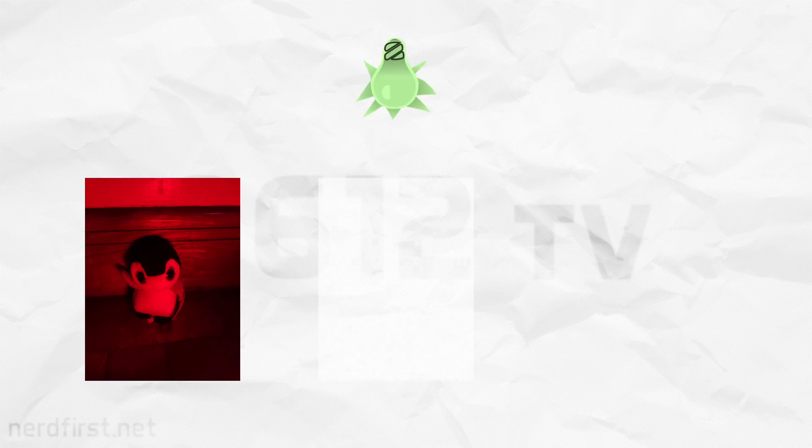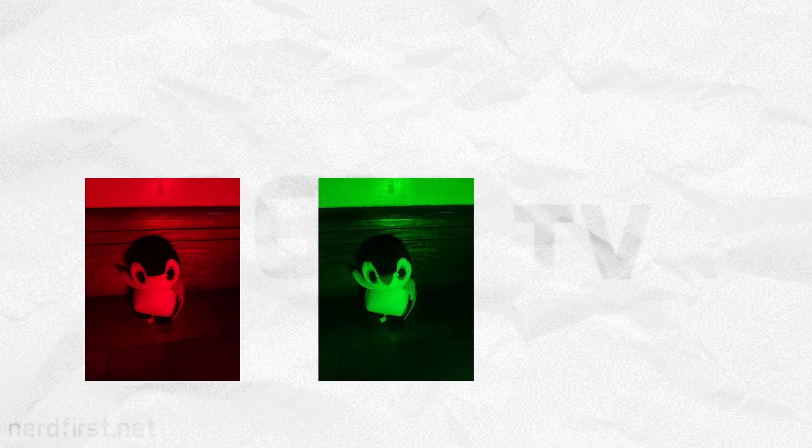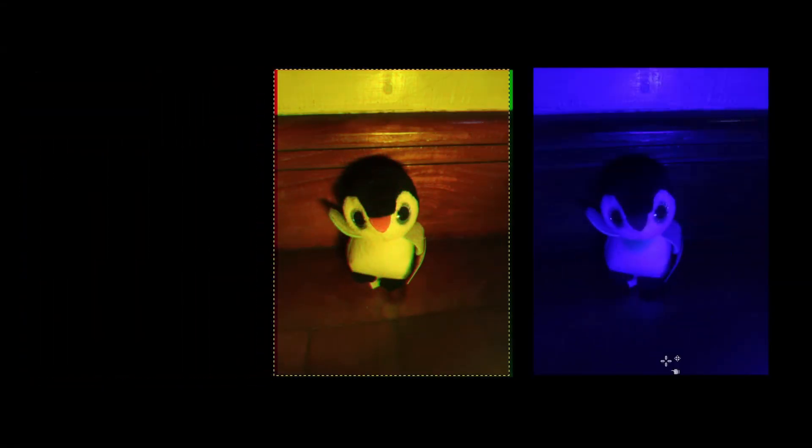The color sensors we've described previously typically also come with several LEDs which serve to illuminate the surface to increase visibility. This, I thought, is where we could try something interesting. If you light an object with colored light — say green — surfaces that contain a green color would reflect that colored light, while surfaces that aren't green would absorb it, appearing dark. So if I could send out red light and take a measurement, then send out green light and take another measurement, then send out blue light and take a last measurement, I could effectively measure the red, green, and blue color components separately over time and put them together to make up color information.